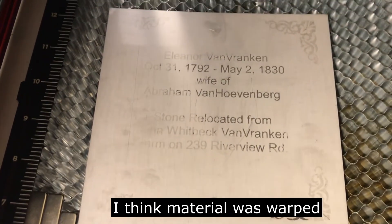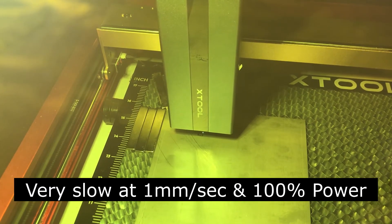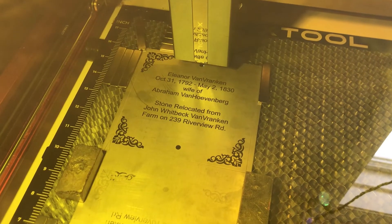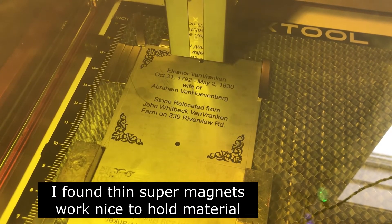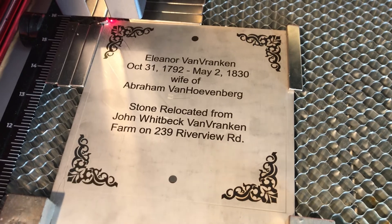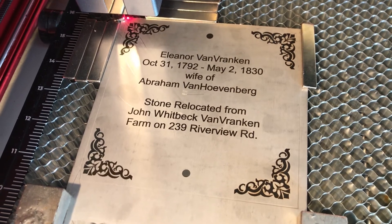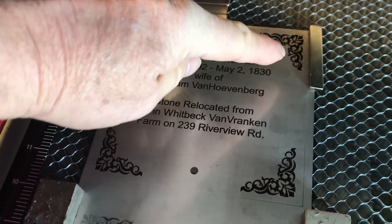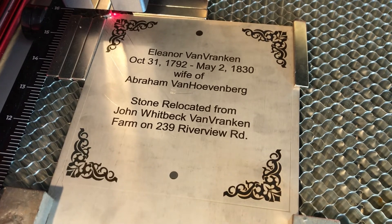This time I'm doing just the plain stainless steel. The stainless steel sheet warped on the top right corner so it didn't engrave there because it was out of focus, so I'm just redoing that one corner. This sign has direct laser engraving — no black spray — and I had a problem with the top edge warping. I redid just the one corner and it came out very nice. Now I have to figure out how to cut it.